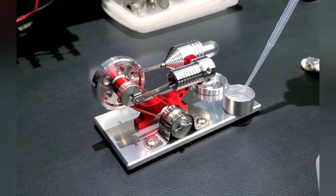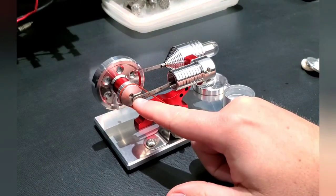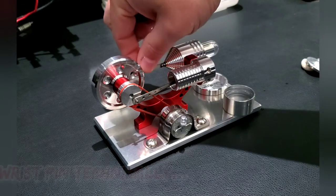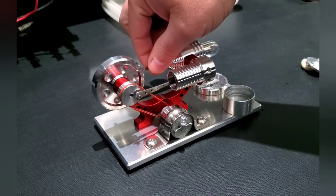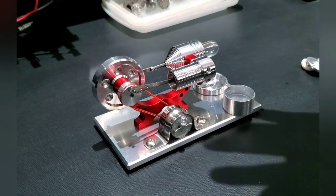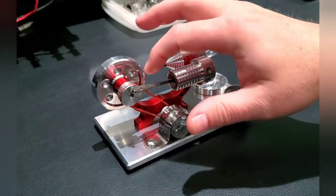While I'm filling it, I'll talk about maintenance. When I got it, it ran perfectly fine — no issues at all. I wanted to improve it a bit, so I added a little extra lubricant to the crankshafts, since they just kind of free-float on there, and I also added lubricant to a pin and dog-bone joint near the brass slide bushing. These little engines are so precise that any drag from lubricant in there slowed the engine down to the point it wouldn't even light the LED. I had to completely disassemble it and clean everything out with Dawn dish detergent and then Simple Green and rinse it really well.